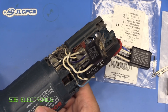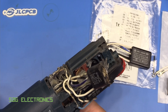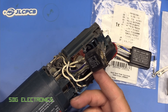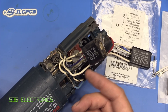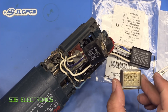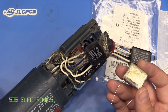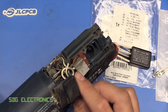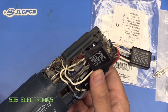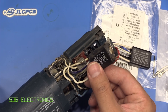The failure mode was exactly the same — you can see all the bits of paper and metallised parts inside. This was actually made in 2004, but it's got very, very low working hours on it, probably about two or three hours at most. It looks like these break down just with age — you don't even need to have used it that much for these capacitors to start failing. A little bit unfortunate, but that's the way it is with some of these components.